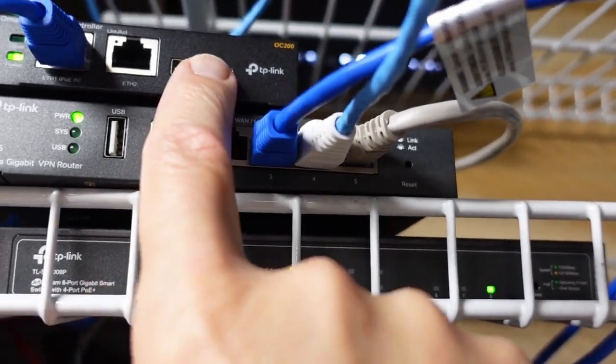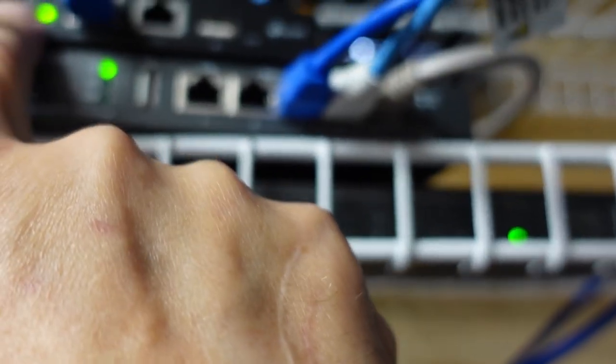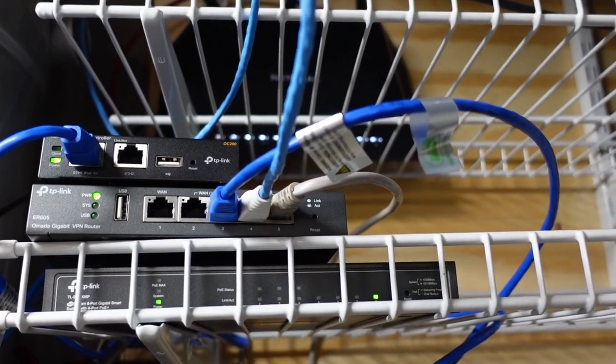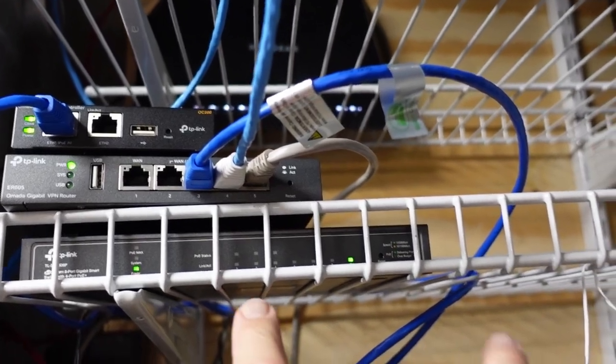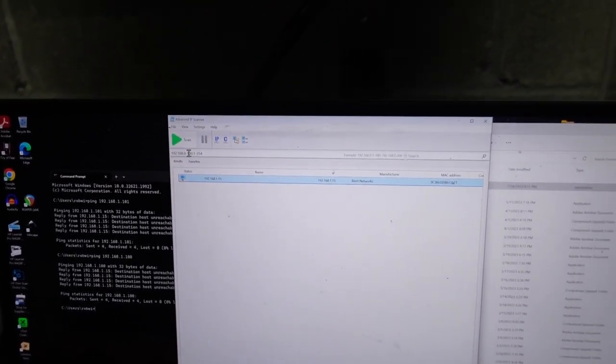I put this together. I've got the controller powered by PoE — that is on port one. Port eight, I've got connected to the router. So the router is connected to the switch, which is supplying power and is connected to the controller. It looks like the basic power circuitry is working, and it looks like there's some communication. I've connected another computer to the router as well, and it should be showing me all the connected devices. The only one that's here is this laptop. I think that pretty much verifies that my router is toast.